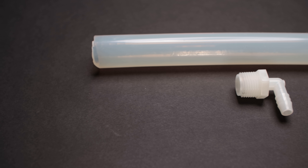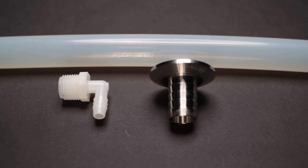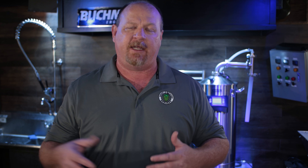The connections to the sprayer are a half-inch MPT 90 to three-eighths hose barb. On the bottom of the T assembly — where the exhaust or exit for the fluid is, the steam and spray from the condenser — that is a three-quarter inch to inch-and-a-half tri-clamp barb. The parts list specs two feet of hose, though a little bit less works fine. When you use this device, you definitely cannot have the outlet end submerged in water — if you do, it completely nullifies the suction and vacuum effect the venturi in the T has on the steam, and it will basically stop working.